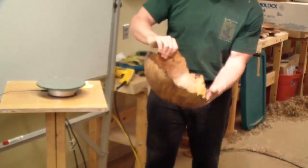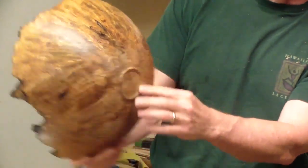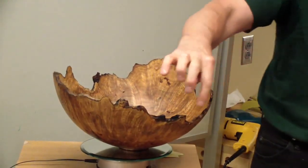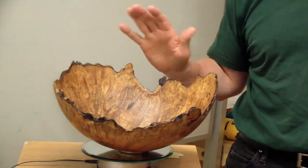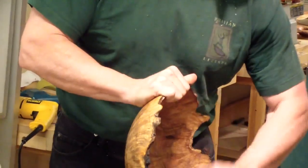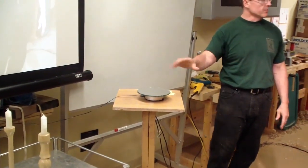This is one of Mike's burls. I was at Mike's sawmill and I just saw a big gnarly burl and he sold it to me. I like a curve that comes down to a smaller foot — that's my preference. It's oiled but not buffed out yet. I like to keep a uniform thickness — I don't like it real thin here and thick up here, so I really work hard on the rim to keep it uniform all the way through. Would you buff the inside? I will. That's going to be a little tricky — when I hold it on the buffing wheel, you really hold on tight. That's maple burl — I got three pieces out of it.